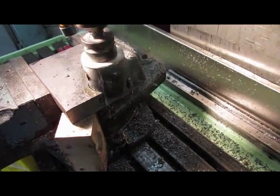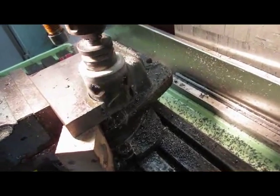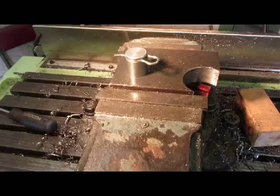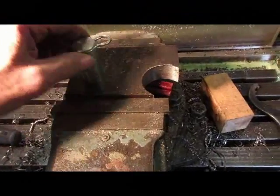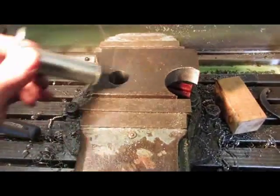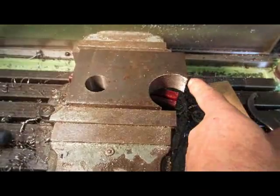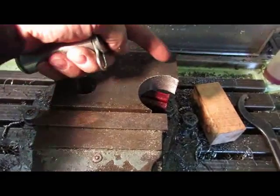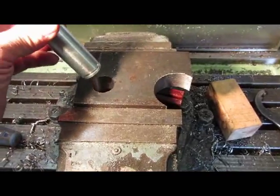It goes through quite well — look at the chips. There's the hole cut through, the slug worked out very well. This is the adapter I made up; it's got a one-inch hole for the pin on the lift cylinder. I'll probably take a little bit of the point off when welding for better penetration, and maybe trim a bit off the top — I don't need all that metal up there. Apart from that, we're just about done. Next step will be to place it and weld it.